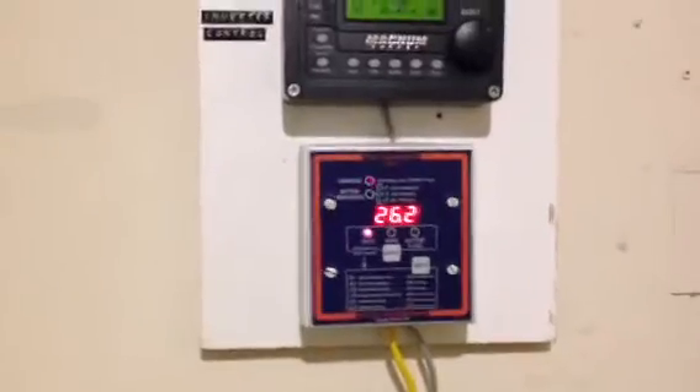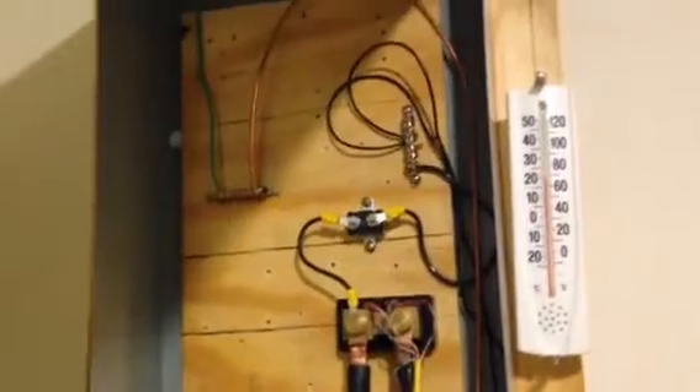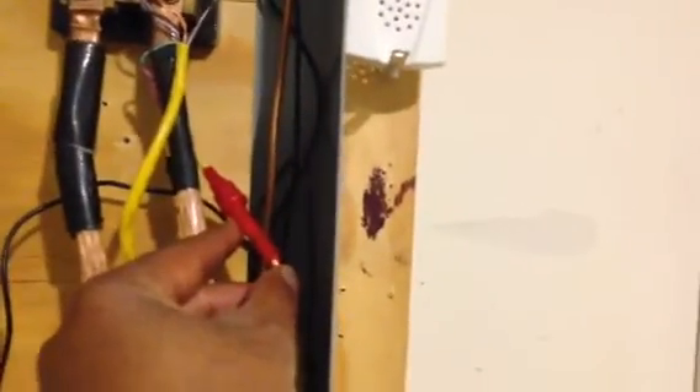As you can see, the battery voltage is maintained at 26.2 volts, which is float voltage for an AGM battery bank — you can't get any cleaner or more simplistic than that. There's a simple fuse between my Trimetric and the battery bank. It's only 9:30 in the morning and I'm already at 730 watts coming into the system. These microinverters appear to be incredibly efficient.